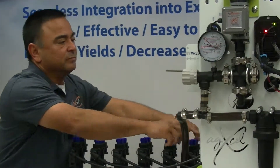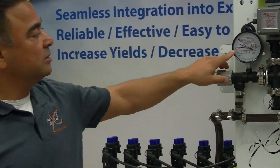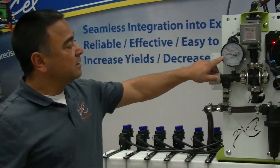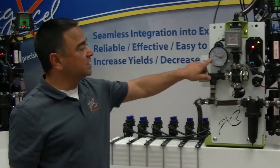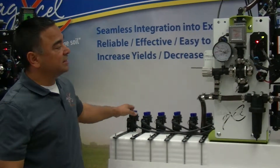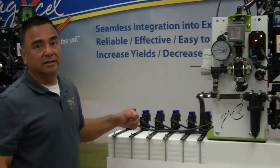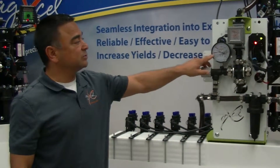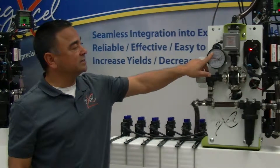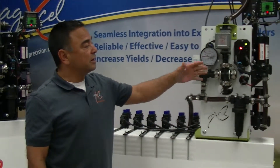In the afternoon or mid-morning your pressure is going to start to drop. You close the larger one, open up the smaller one, and your pressure goes back up, so you have a steady flow. This will only happen typically once a day. We don't like to see pressure below 10 because these are four-pound check valves that need approximately eight pounds of pressure across the boom to open up all of them evenly. We also don't like to see above 20 psi because that just heats everything up.